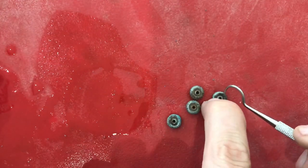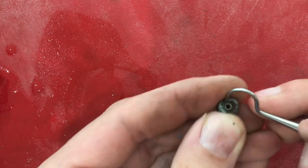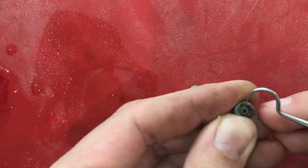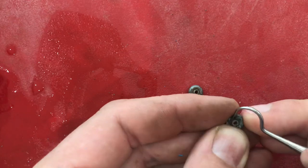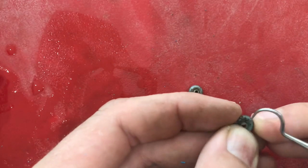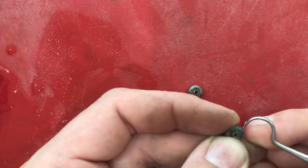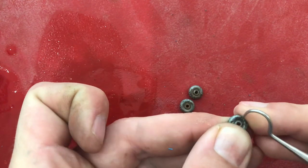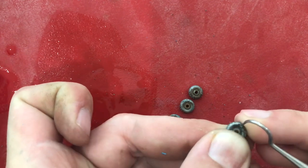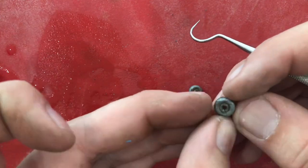With the wheels off, I can turn my attention to some of the over-paint that was on these. The short soak in the vinegar has helped to loosen up some of it, and I could probably pop them into the Citrus Strip. But the pot metal or whatever kind of metal they use on these wheels seems to be really soft and sensitive to some of those things, so I'm just going to go at them with my dental picks.